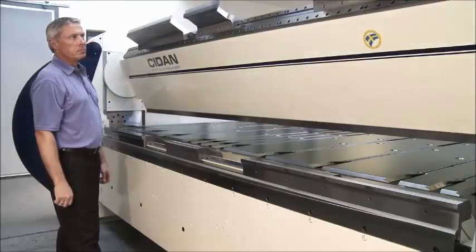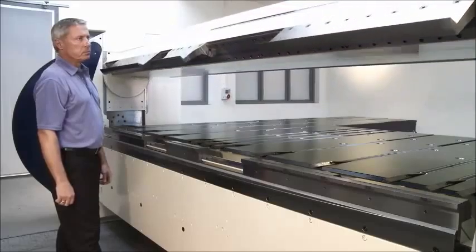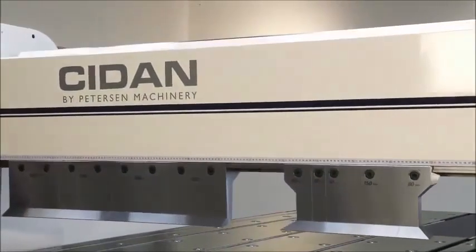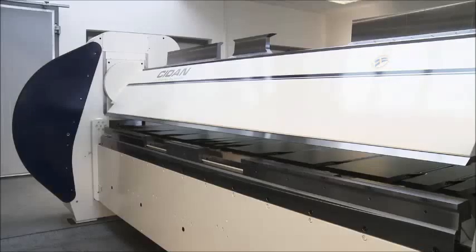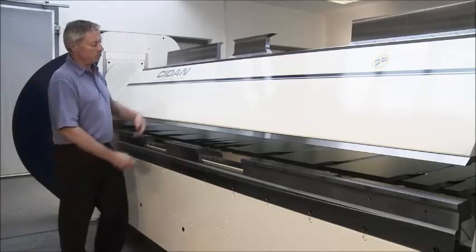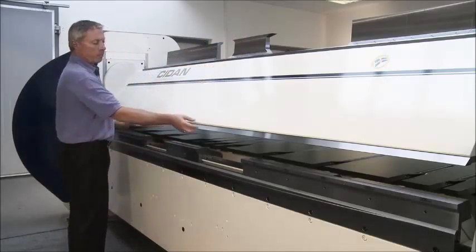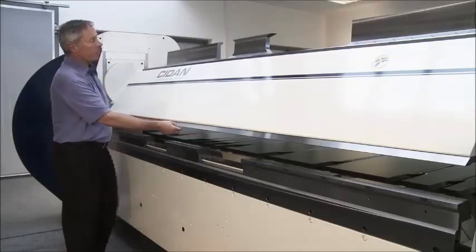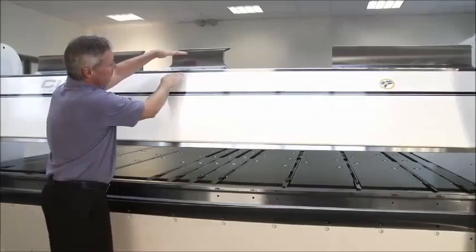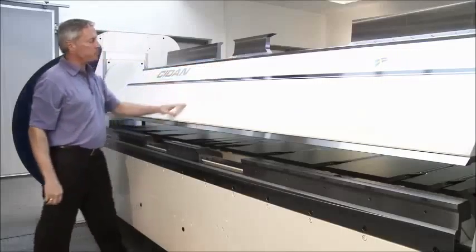This part is made with only one tool setup. Larger sheet may require 2 different tooling setups. For this, we have invented the combi beam. The combi beam is an automatic tool changer, and it is one of our most important developments. It holds 2 different tooling systems: a straight 30-degree rail, and a segmented box tooling with a height from 100 up to 254 millimeters or 4 to 10 inches.